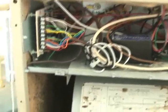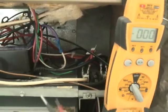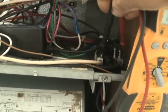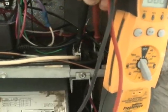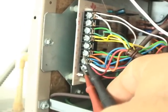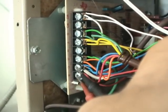If the breakers are on and the blower is not running, then you could easily have a problem at the air handler. Check to be sure that you have line voltage coming in — set your multimeter to read voltage, put one probe on line one and the other on line two, and you should have 240 volts. In this case we do not, and that would be the problem. If you do have line voltage, then check to be sure you have control voltage out of your control transformer — put one probe on R and the other on C for common, and you should get 24 volts. If you don't get 24 volts, that points the finger right at the control transformer.